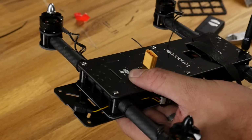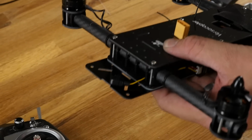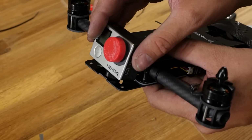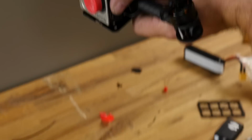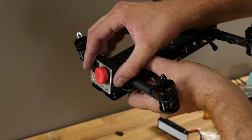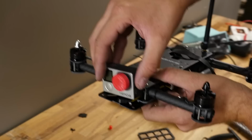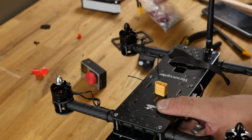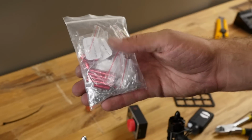And I'm actually going to take 2 little simple grommets you can find at the hardware store, and I'm going to put a cushion. A lot of people do different things. I prefer using a little bit of cushion and angle this back, so when we're flying forward, we have a nice level shot. But if you're just starting out and you have auto level, you can go flat as a pancake right here.